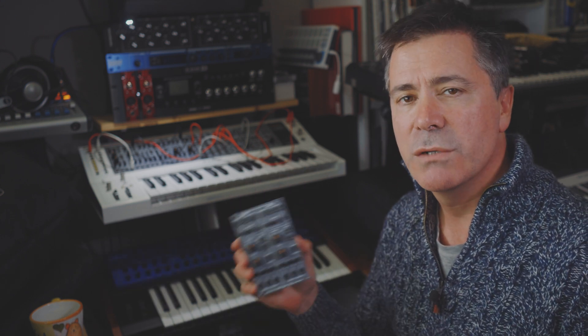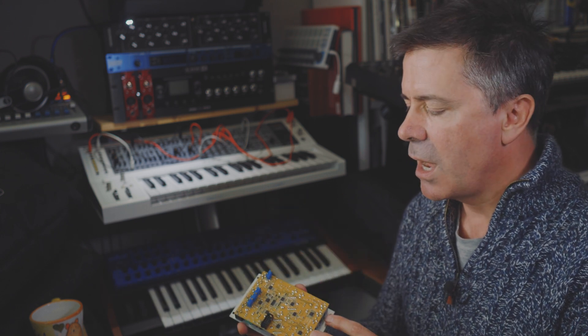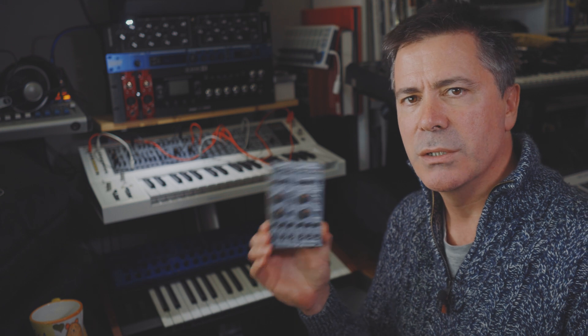I haven't played the new module for you to hear, but trust me — looking at those graphs, the difference between the old and new one is night and day. It's really great to see Behringer being so proactive in identifying the issue, coming up with a new design, and implementing it so quickly. If you have an old module that displays the same issues, you have two choices: recalibrate it using the trim pots, which will make it more usable but won't eliminate the initial temperature sensitivity, or get in touch with your retailer about a replacement unit.